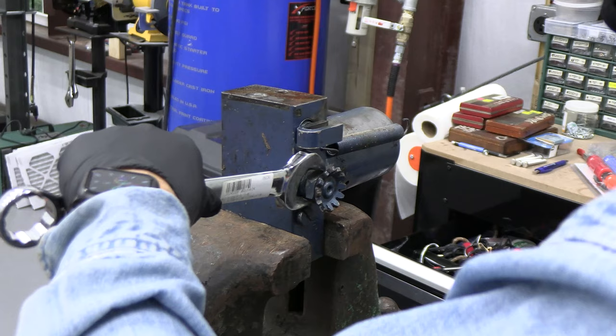I'm tightening that big screw. This is the screw I was tightening. I can't tighten it anymore. And this is that 29 millimeter. Good. So we replaced this O-ring, cleaned out these holes so there was good movement of fluid, cleaned the threads. I took out that oil seal. And then to reseat it, this is actually a 1 1/4 inch socket that has been seated. That's in good shape.